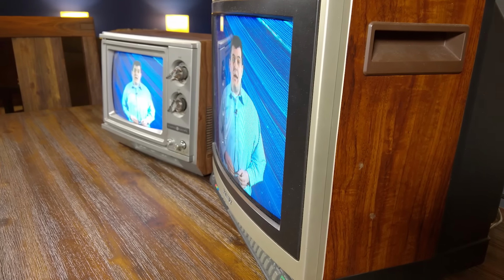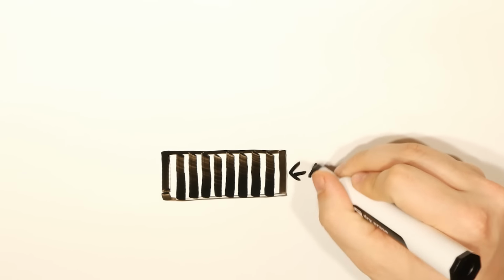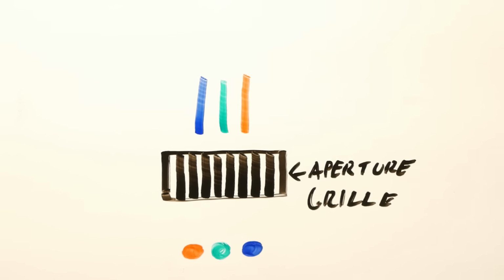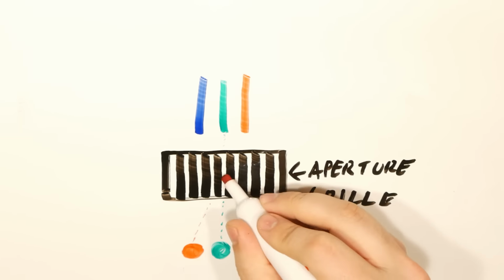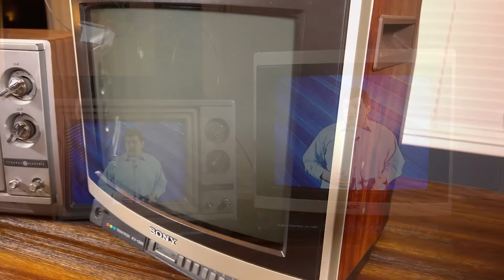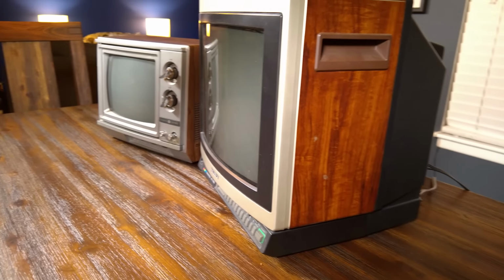This is actually a requirement of the aperture grille. The aperture grille is fundamentally simpler than the shadow mask, as it only needs to block the electron beams in the X dimension. Three separate beams arranged in a line can be separated with just a slit. With the green beam in the center, it can pass straight through, but the red and blue beams can only pass through the left and right, respectively. But this arrangement requires the slits in the grille to always be perpendicular with respect to the three beams' linear arrangement. In other words, the grille had to always stay completely vertical, as any tilt to the left or the right could cause crossover and you'd get messed up color. We all know from Ghostbusters that you shouldn't cross the beams. So Trinitron tubes were designed to only curve in the X dimension, keeping the face of the tube perpendicular to the electron gun along its width, and the beam separation angle constant along its height.